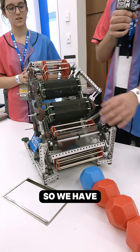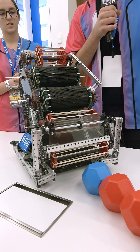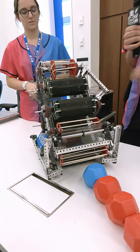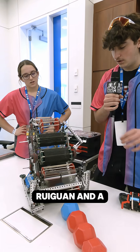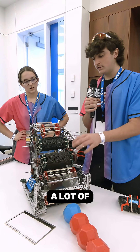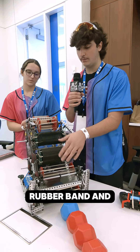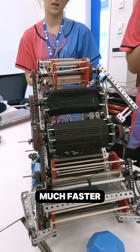We have just a straight path in the intake, initially from team 9123X, Rig One. A lot of teams do this intake and they have flaps. Instead, we do all rubber band and mesh rollers. The reason for this is it's just so much faster.